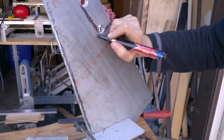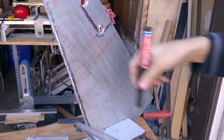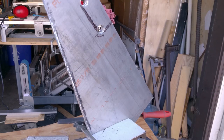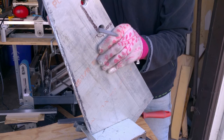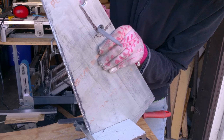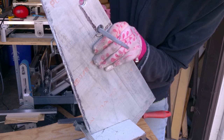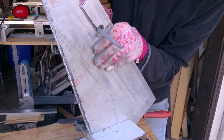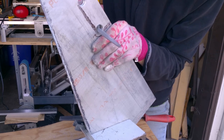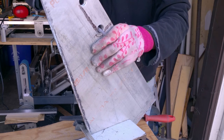I've got to file this quadrant here. Arms are heavy so it actually helps to have the part you're filing pointing down if you can. Oddly enough this file actually ejects the machining chips if you pull it a little bit, which is really strange - it clogs it up more and ruins your file if you do that with steel. I went to the hardware store and bought these - they're Bosch blades, 12 teeth per inch and that's really good for this. These have been cutting a lot better, about four times as much, and these aren't getting clogged up like the other ones.